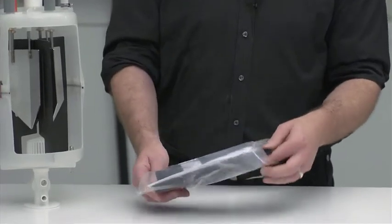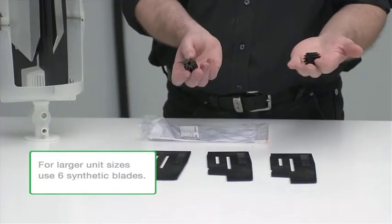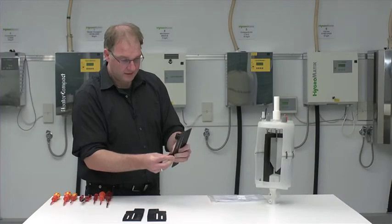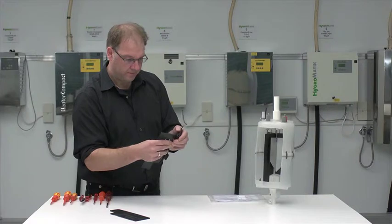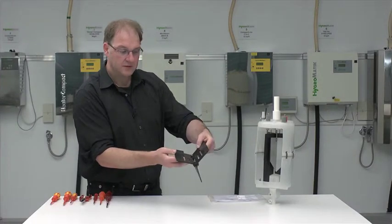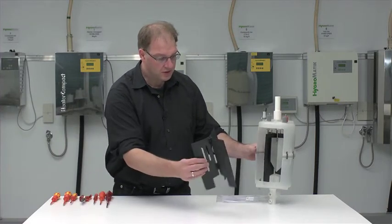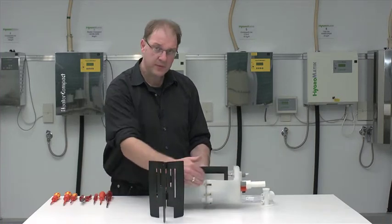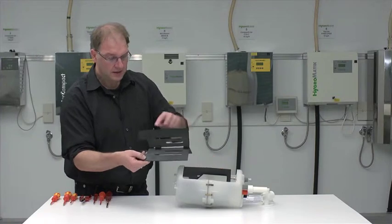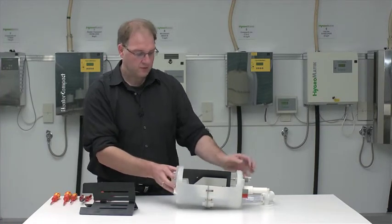The cylinder star comes in a small assembly kit consisting of three synthetic blades and two stars. These stars are simply present so I can stick these three blades together. Resulting in this typical star shape. This is the exact same star that is in there. To install the star you will proceed as follows: you open the cylinder, separate the two halves from each other. The cylinder star is then inserted into the top part in such a way that the blades are arranged right between the electrodes. Then the whole thing is reassembled and the clamps are placed back on. That's how simple it is.